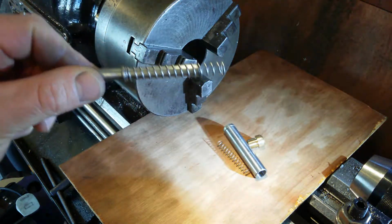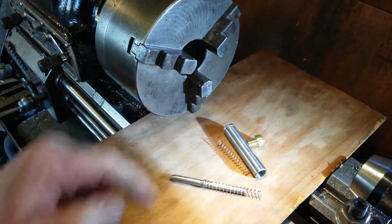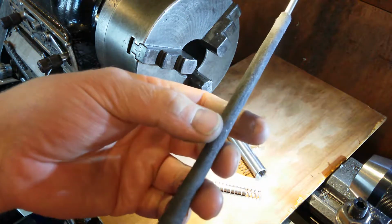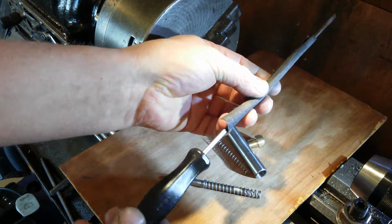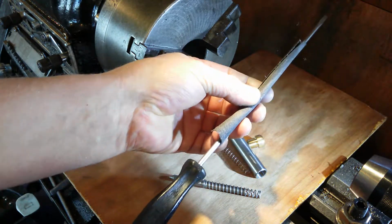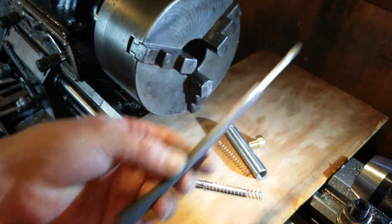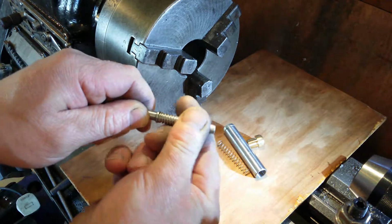Unfortunately, I ordered it a little bit too long, I think. Not to worry, and the way I got that to fit is I didn't take the shaft down. I wrapped a piece of emery cloth around a long screwdriver and did some bodybuilding, wiping the spring up and down that for about 10 minutes. But the desired effect was complete.